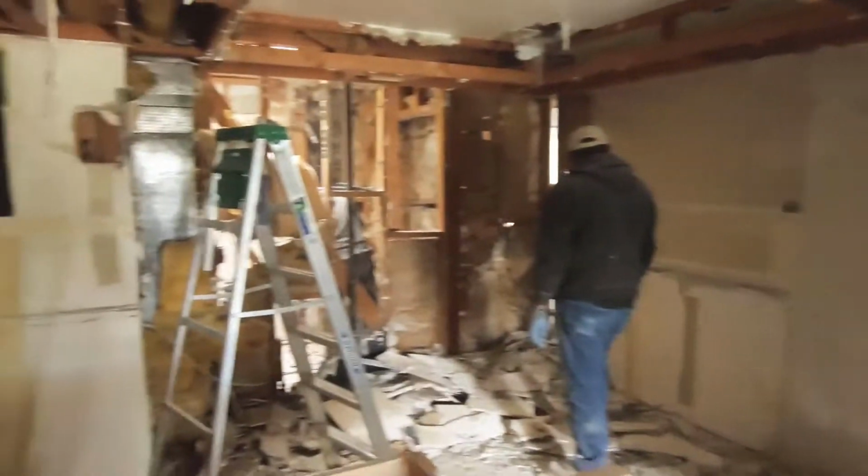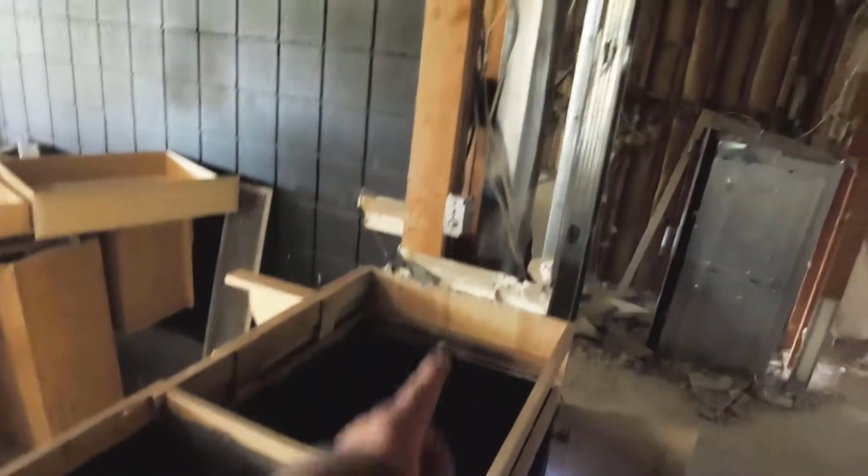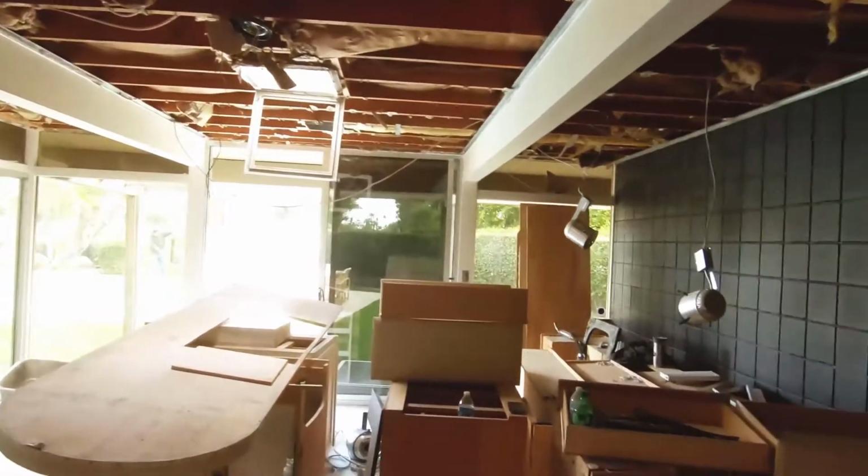One of the mysteries that we're able to confirm is that in that back soffit in the kitchen, there's indeed HVAC coming up. So now the point is what we can do to make that work with how the plans show. Yep. So we either leave it and make it work, or we maybe do a toe kick return, but it's going to change how that kitchen's going to look one way or another. And then over here we had our exhaust vent. This is where the cooktop was. The vent goes down, runs over, up the wall, across the top, and then out the ceiling. Good news is we get to abandon that because what we uncovered was the old vent location, which is exactly where we're putting the new vent. So that's great news.